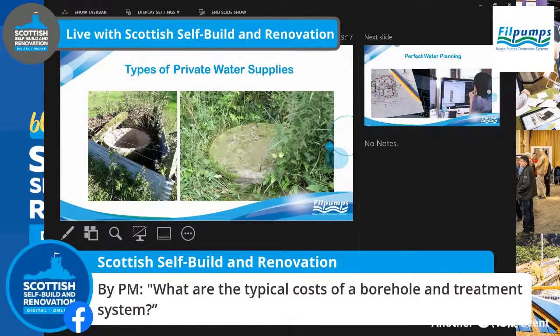Another common problem is that if another well is made by someone else, perhaps in a neighboring field, then they are drawing from the same reserve of water as you, which can then limit the amount of water your well can provide. Now, don't take this to mean that wells are completely unusable. A lot of wells have provided plentiful supplies of water for many, many years. However, our ever-increasing demands for water is putting traditional water supplies like these under pressure. So when building a new home, if you are going to make use of a well supply, then you need to consider the factors just discussed. This may mean additional infrastructure in order to maximize the best use of the water and to mitigate any potential shortcomings.